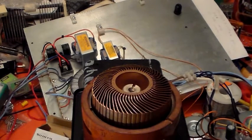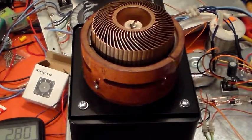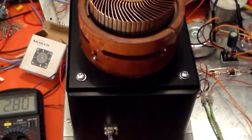That's going to be down to a couple of things, I suspect. One will be the overvolts — as I say, they're supposed to be 13.8 and I'm running at about 15.6. And the other is that the volume of the airbox has been reduced, because I've stuck the sound deadening stuff all around the inside, and there are components in there as well now. So the actual internal volume of the airbox has been reduced.